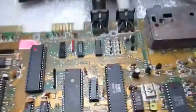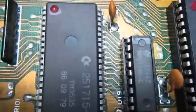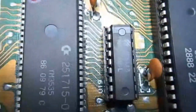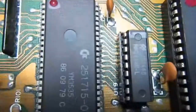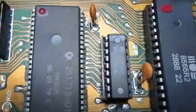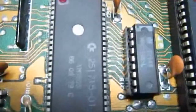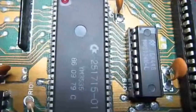Let me explain what I did and why I decided to change the color RAM. I made a little BASIC program to test the address range where the color RAM is mapped into the CPU address space, which in hexadecimal is D800 to DBFF. It only uses the four lowest bits — the lowest nibble.